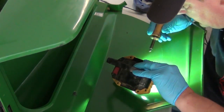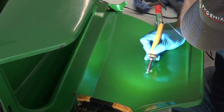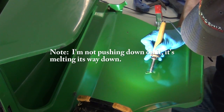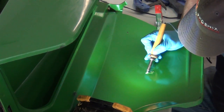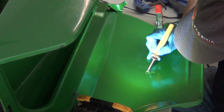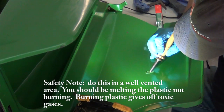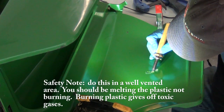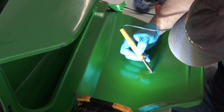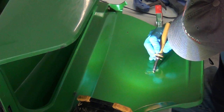That's the reason I've got this light. It looks like the crack starts up to here. When you put the tool on this plastic — oh yeah, it just burns right in. I'm going right down the seam of it, and when it's still hot you just kind of fold the plastic back over it. One cool thing I've heard about too is you can take a piece of metal — I got some scrap copper wire — lay it across the seam, melt it in, and it actually reinforces the bond.